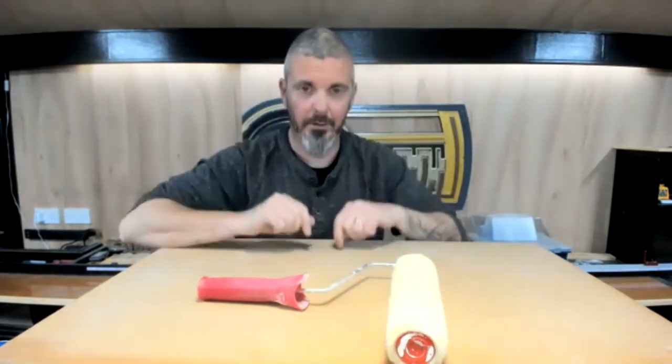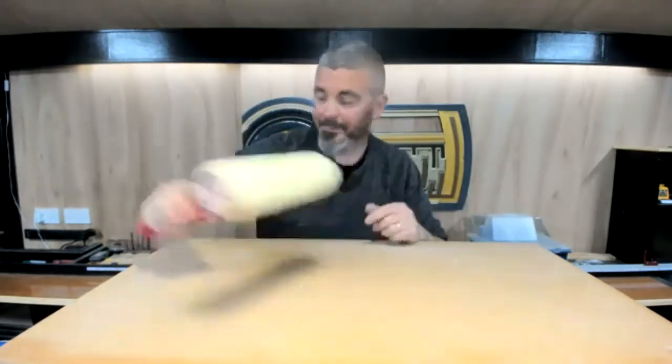Do up, do down, do the middle, but always first do the edge, and you work your way in. And is that final pass over the whole wall straight after you finish the middle piece? Yeah, pretty much, because you have a lovely band in the middle of lovely, fresh, wet paint, and you're just spreading that out now. It really is all about getting it all nice and wet at the same time, so it can all dry at the same time.